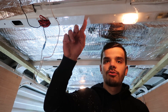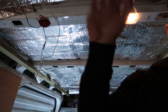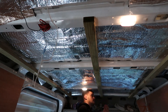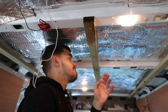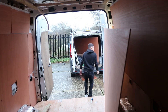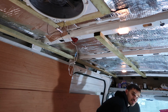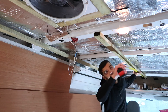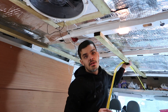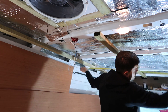As it's quite windy outside, I'm not going to film myself cutting it — I'm just going to time-lapse it inside and come back to you when that side's done, then we'll move on to the other side. Now what we've got to do is start screwing this panel onto the metal and carry on working our way down. It needs to stop raining. So what we're going to have to do is cut the plywood in two sections — I'll cut the plywood in half and do it in two sections as it's hard to stick up by yourself. I'll measure how long it is: 2.2, so we're going to do two at 1.1 by 1.20 wide.